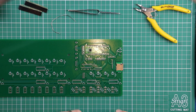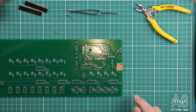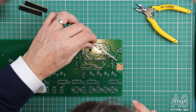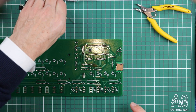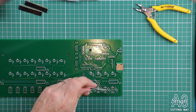The good news is you're not going to start by soldering those very fine pins. We need to first secure it in place by soldering each of the four grounding points. There should be enough flux in the solder to do that.